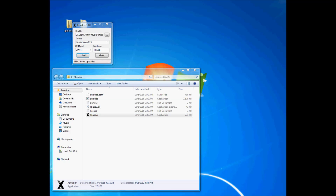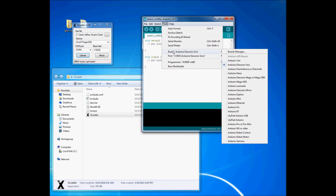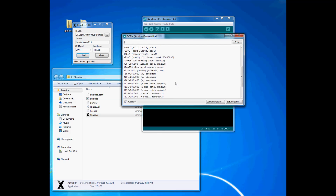I'm going to open the Arduino IDE again, bring that over, hit Tools, set it to the Uno, set the port to COM4, and hit the Serial Monitor. There it is — this proves it's working because it repeated back that it's GRBL, and this shows the current configuration. We know it's working. This is the last step of getting the firmware onto the machine. The firmware is on, the Serial Monitor is responding correctly, and we're good to go.